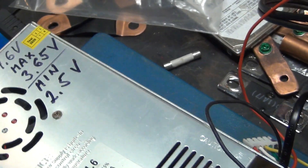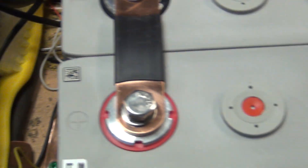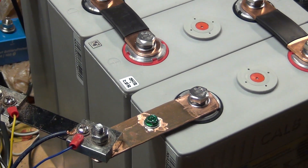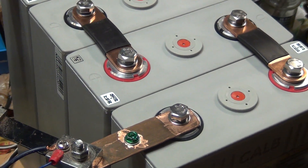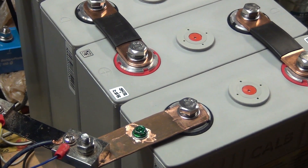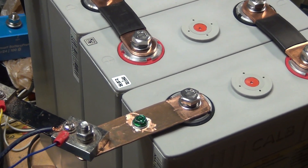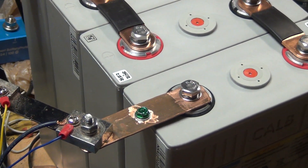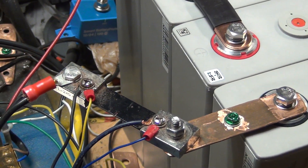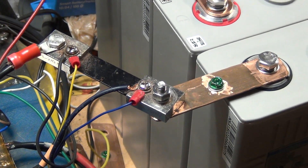All I want to say is — I'm shutting the charger down now, I'm done charging, I don't want to go any farther. These are new cells, they've never been used, and they charged about 196 amp-hours — that's how it's supposed to be, and that's good. Even though they are matched from the factory — the best match you can ever get — they still will not be exactly the same capacity. So no matter what you do, you always have to use a BMS, and it's a really good idea to use a 5-amp balancer — those are the best balancers. I guess I rest my case: this company is selling brand new cells, and that's good.